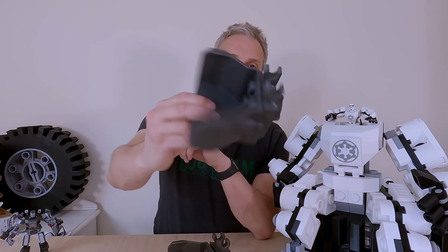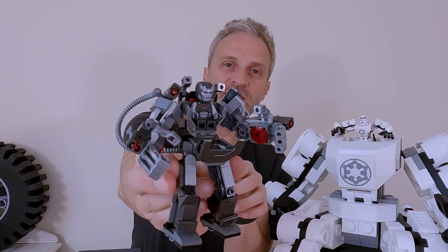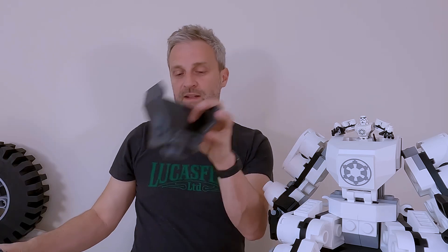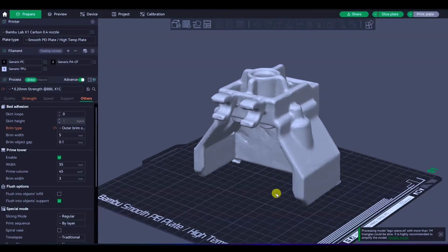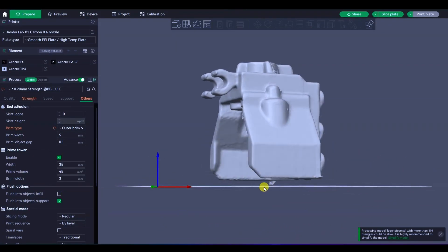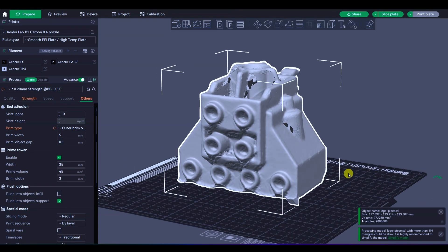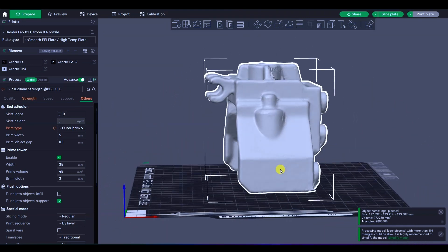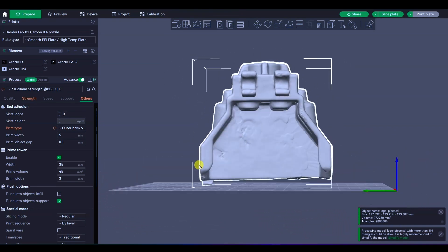One of the more difficult parts to print is this piece, which forms the front and back of the cab — you can see him sat in there. A lot of people ask me why you can't just scan these parts. It's very hard because if you scan them you never get truly flat surfaces. The scan has lots of detail but there are all sorts of problems: none of the surfaces are flat, some of the circles aren't round, and there are holes all over the place. If you try to print this and fit it to any of my other parts, it just wouldn't work.